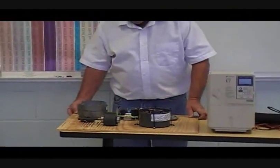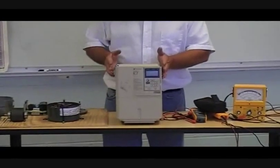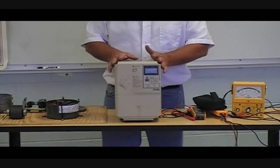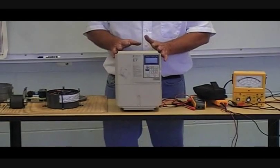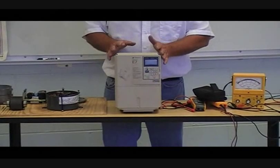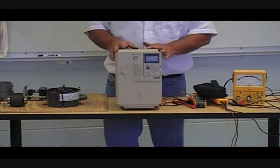In the residential and light commercial end, these capacitors don't have the kick that you will see in the commercial end. In the commercial and industrial end, we use a variable speed drive — which is very similar to the ECM — such as this one. Let me warn you: these things are lethal. They have capacitors in them that can hold the charge for five minutes or more. In fact, if the discharge system is not working correctly, it could be a very long time that it would hold the charge. You must check the buses in there for both AC and DC. A person will measure it with AC, think there's no voltage there, stick their hands on it — they may not live to tell about it. Please be careful on that.